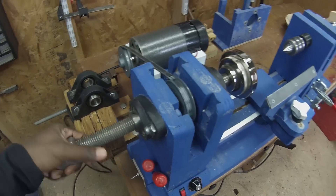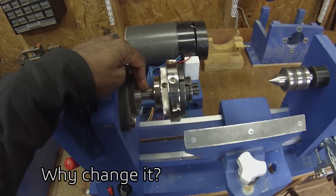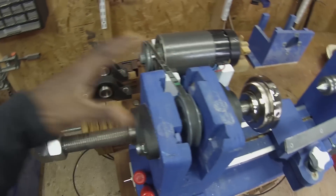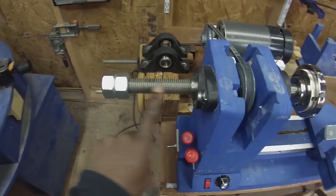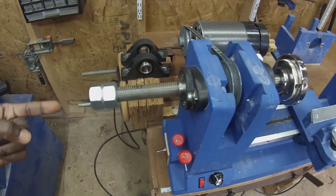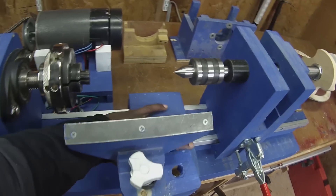I started with a 5/8 threaded rod, and then the one inch threaded rod — there were a lot of different chucks you could buy that would fit that, and so that's why everything is designed to fit this size rod. You may notice that I've got this long piece of threaded rod sticking out here, and the reason I did that is because it allows me to adjust the chuck forward and now I've got space behind it for the tool rest.